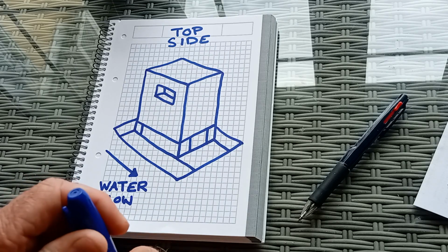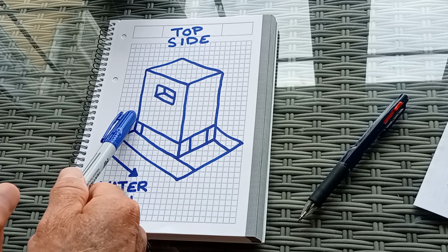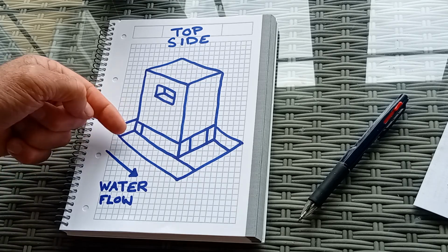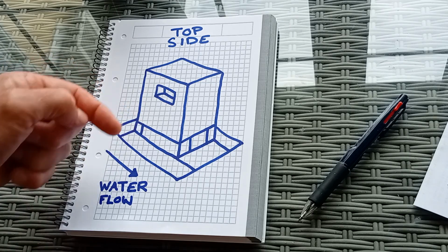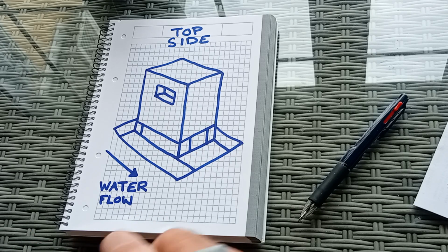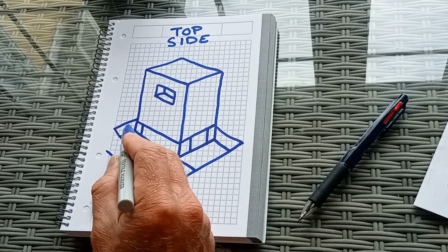Lastly, the top flashing piece will overlap the sides, and now you have all of your seams flowing downward. So it looks something like this. Coming across over the side and then wrapping around over the side flashing, and the same on the other side. You may notice 4 points of weakness at the bottom corner of the flashing, right here, here, and here.